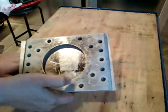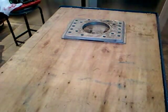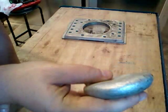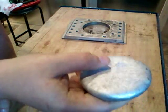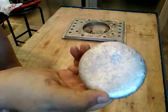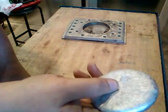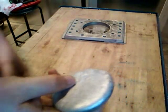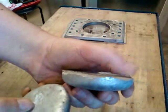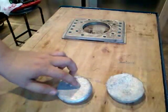These are total crap for melting. Here's an example of extruded aluminum that was melted — as you can see, it flowed out of the crucible all right, but it did not want to flow. The edges are all rounded over. Now this is normal cast aluminum — see the sharp edges, how it flows? The difference is the silicon content in it.